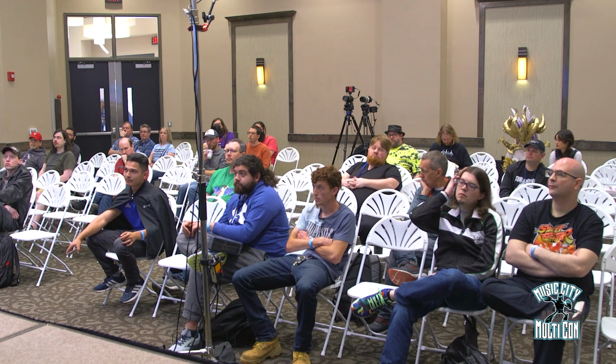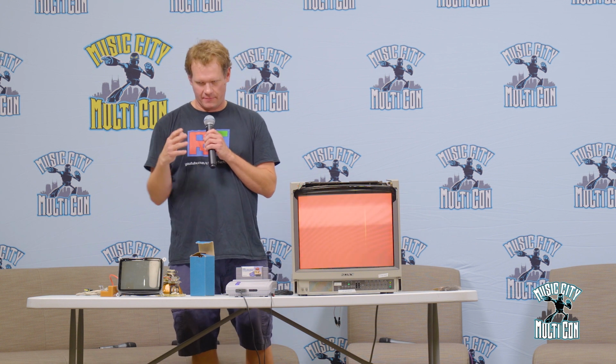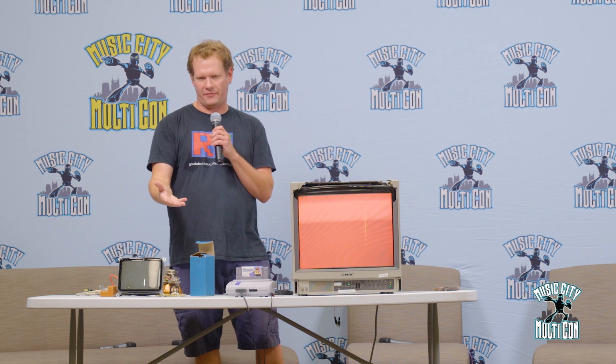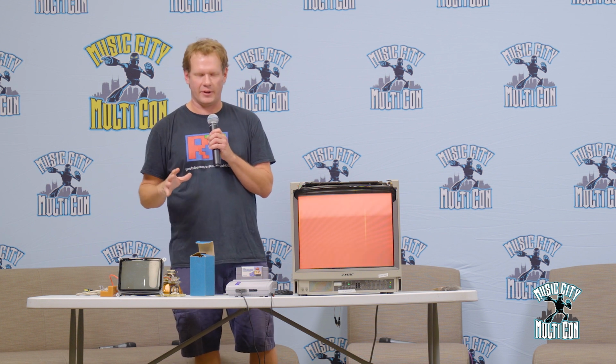Okay. The only thing that will really affect your tube is contrast and brightness. If you pump those really, really high, it can wear out your tube a little bit faster. Sharpness won't matter, and any of those other kinds of filtration and things like that are not really going to do it.